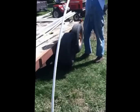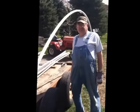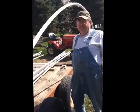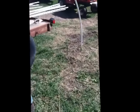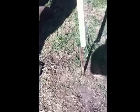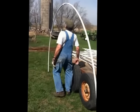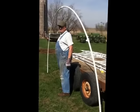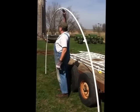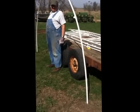We're mocking up the end piece and checking our head height. At a 14-foot base it may be a little too low, so we've set up another mark at 12 feet to see what that looks like at the next rung. We have the rebar nine inches up and it's holding nicely, adding about 16 more inches above head height. We're going to consider this height or split the difference and go with a 13-foot base.